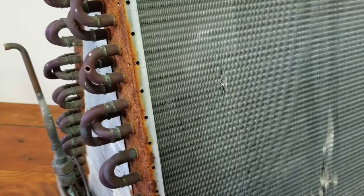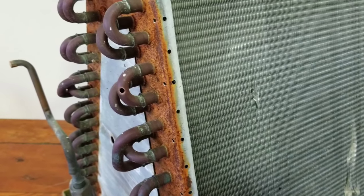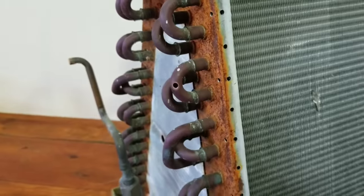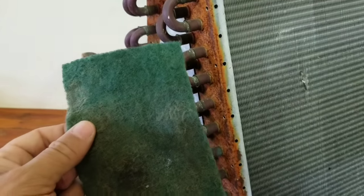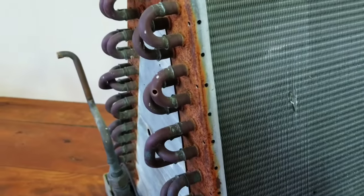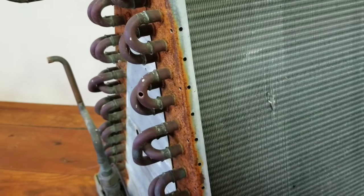That's what we're going to do today — just playing around, and it's a good little training for the apprentices, the green guys, and even the experienced guys because practice makes perfect. First, we'll address the tube sheet. First thing I'm going to do is clean this up, and what I typically like to use is just these little Scotch-Brite pads. They hold up pretty well, they're pretty abrasive, they work very well, and it's easy to keep a little square in a tool bag or torch tote. We'll go ahead and clean this up and see if we can get the hole fixed, then move on to the fin pack.